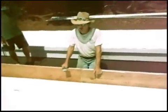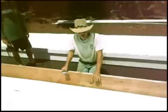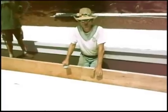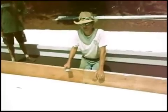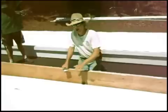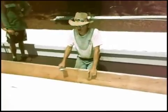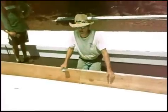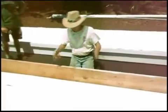We're going to cover beginning to put the trough liner in. Where you start is you cut a piece of trough liner that's three feet longer than your trough. If you have a 32-foot trough, don't make the mistake of cutting the trough liner 32 feet long, because then you won't have enough to go up the end of the trough and over the top. We've allowed the trough length of 32 feet plus another three feet, so we have a total of 18 inches excess at each end.